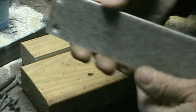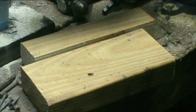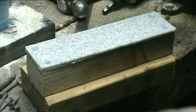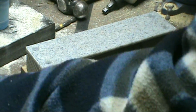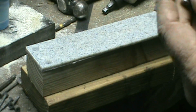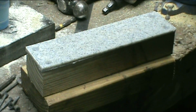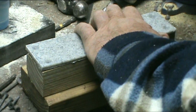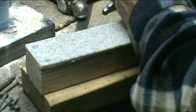But anyway, I've got the corners drilled and countersunk right here, and they go on this right here. So now, since these are a little bit bigger than the 1/8 drill bit, these look like about a number 10 screws, I'm going to go ahead and run a 1/8 pilot bit down through there. I'm going to run this pilot hole down through there, just for that. Okay.